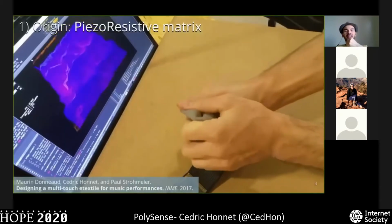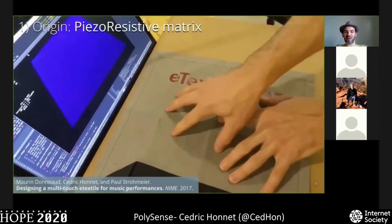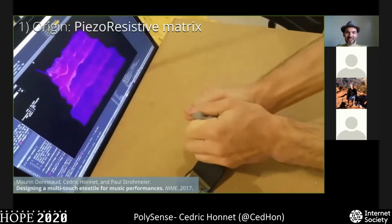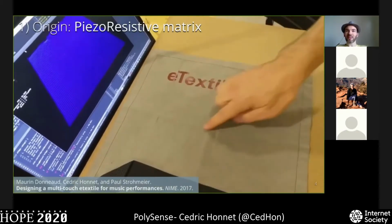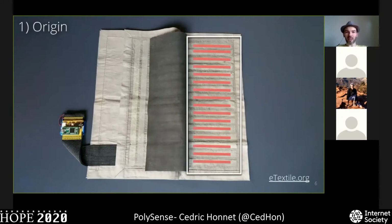This project was born at DataPolet, a hackerspace collective focused on e-textiles, such as this matrix pressure sensor. This particular sensor uses two kinds of materials. Let's discuss first the conductive fabric. On the right, we can see horizontal stripes used to sequentially power the sensor for rasterization when we read the sensor.